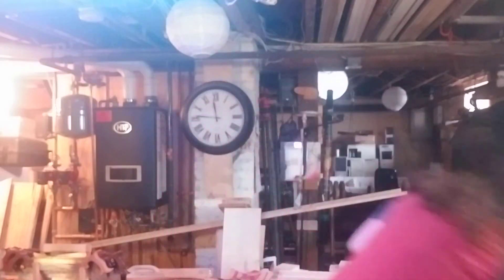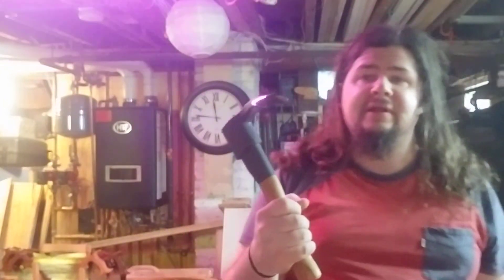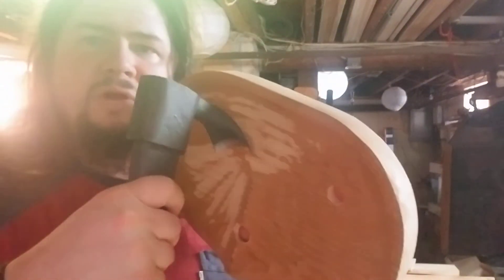Now if you do want to carve the seat, one good tool to have is an adze. I have one here made by Narex — it's probably not the best possible one but it's been good enough for me and it's one of the affordable ones. It's essentially a very sharp scoop with a handle, and you swing it like this. This one in particular likes a little bit of a pulling motion as you're swinging so that it cuts, which allows you to remove a lot of wood from the seat.